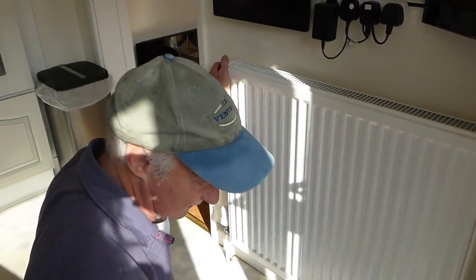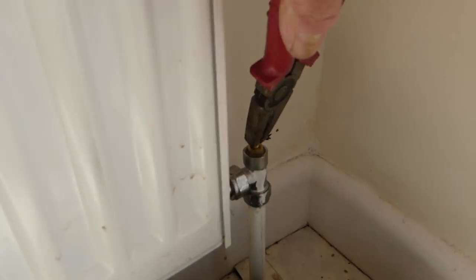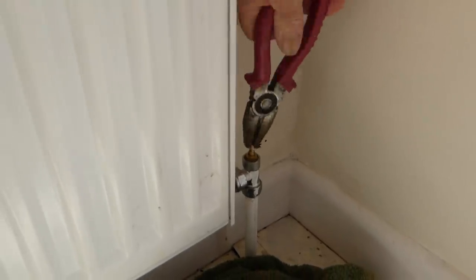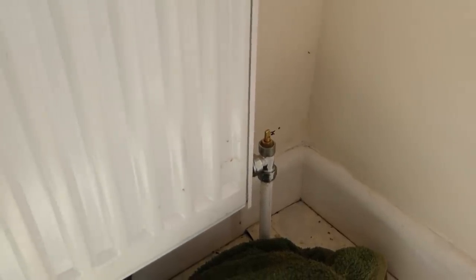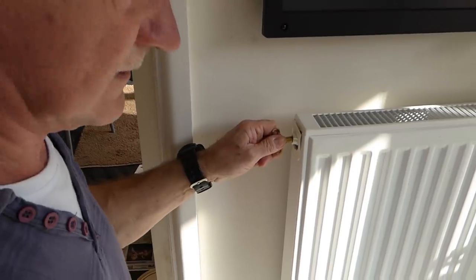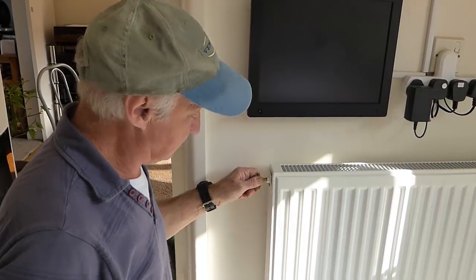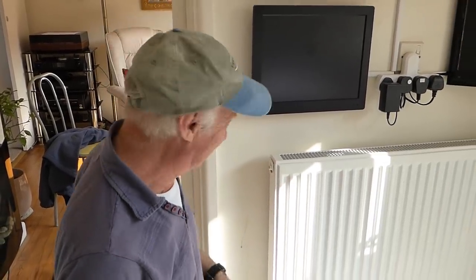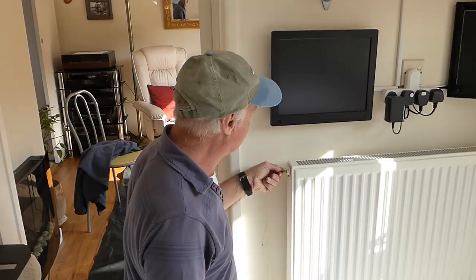Lockshield end — don't forget to count how many turns you put it on. Do it the same amount you turned it off. Very important — we don't want your system unbalanced when we're finished. Now bleed the radiator: let the air in and bleed it out. When it's full we're ready to go. Turn the heating back on — there's the water. Best to have a cloth under it rather than let it go down the wall. Shut it off and we're ready to go.